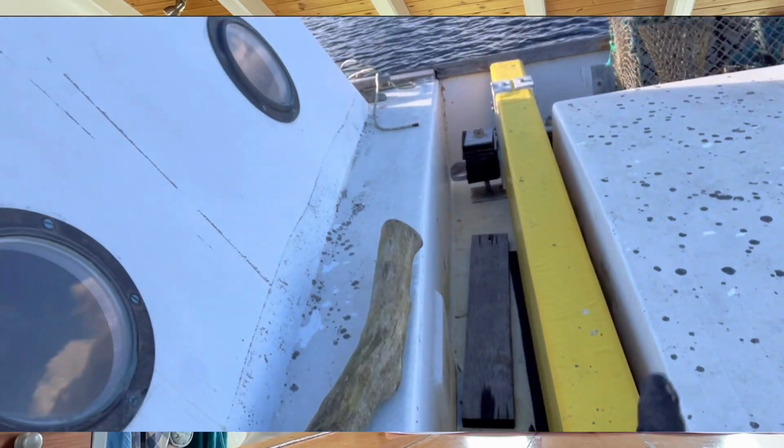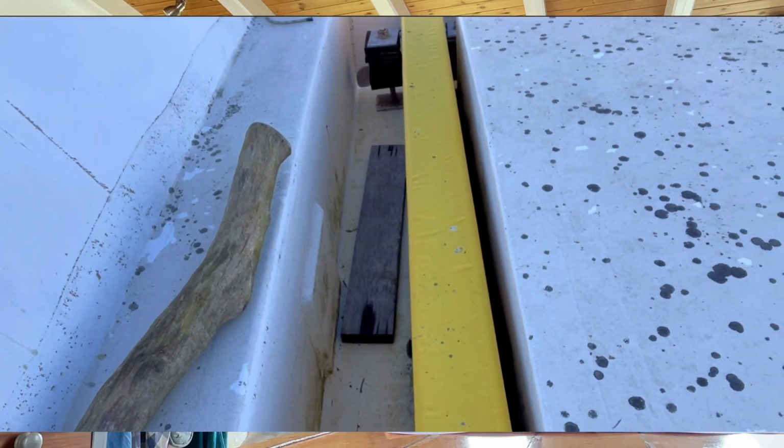Now, before I do that, I have these cabin roofs where it's actually more above the locker section, but where the beams have pressured down, which I've shown in the last video, and in some cases it's cracked. It's actually cracked at the join where the bulkhead of the cabin roof is, and the beam where it sits here, it's separated some of the plywood there. So that's something I have to repair. So I've got to lift the beams and repair that.